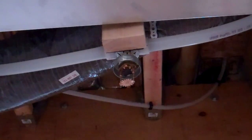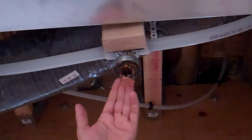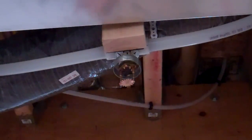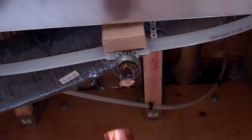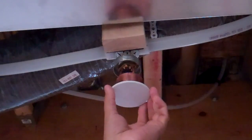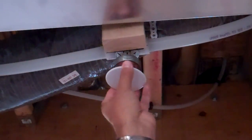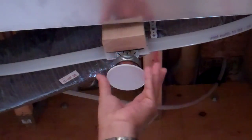After a fire, after a unit has been engaged, a plumbing contractor or a fire crew can simply come with another provided unit cap and replace the head unit and reinstall the cap so the system is operational again.